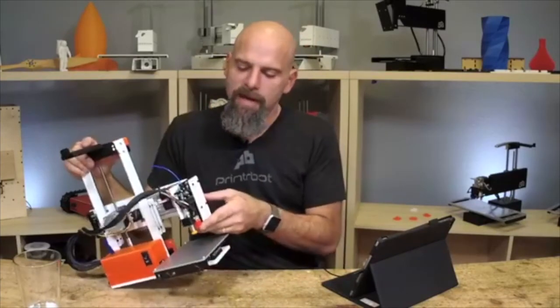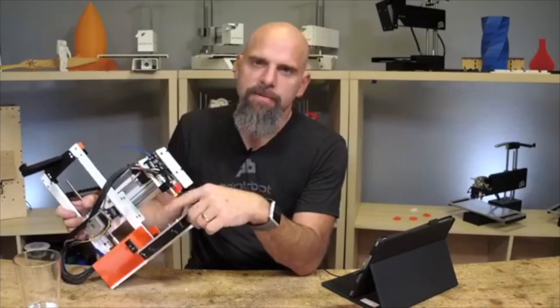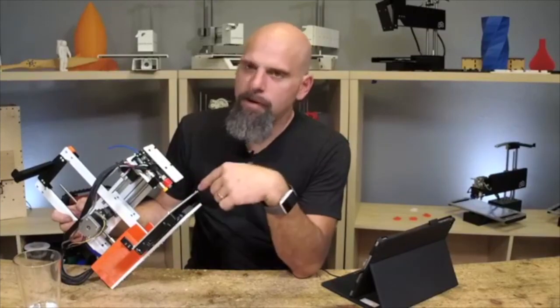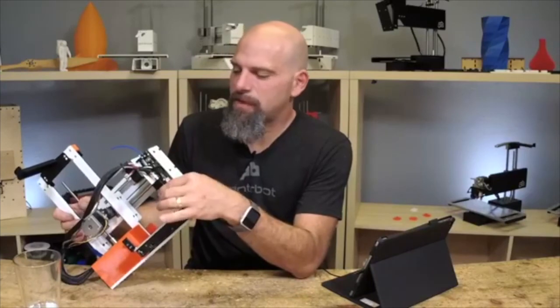But do go with, you have a board probably that doesn't use the Z sensor. That auto bed leveling. Some guys have the RevD board, which used a micro switch for the Z. This is worth investing in. It's just a few bucks, but you do have to upgrade your board. So you could get a new Rev F6 or something. Or there's other boards out there that support it.